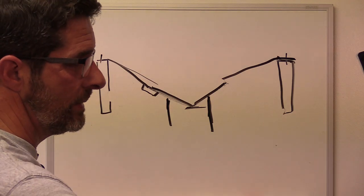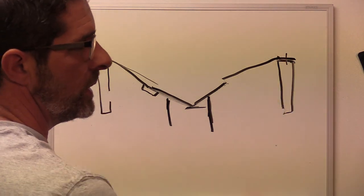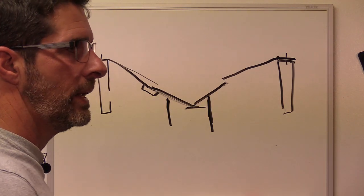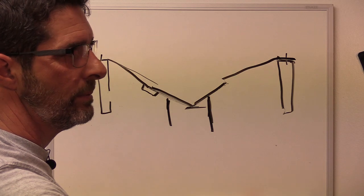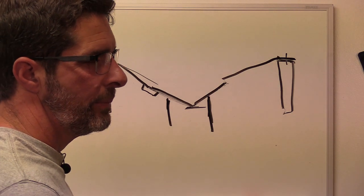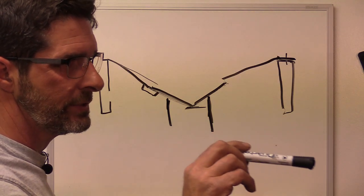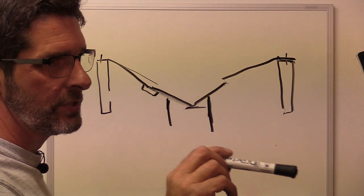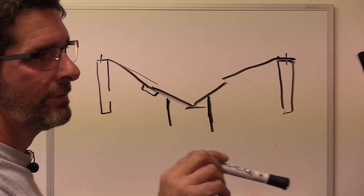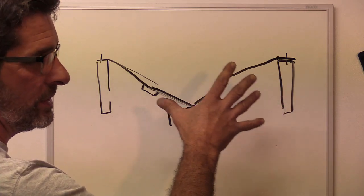So that's the fix. That's building a stand, the center supports, outer supports, flat and level, taking the hull down, every tack and every weld I've done, engine bearer assemblies, all the way back to the transom. Everything comes off. And believe me, just doing the front end and having to clean up all those tacks and get all those surfaces even again takes a lot of time, sanding discs, you name it. Now I have to take this whole boat down to the keel to do this. And I have to build a jig for the boat